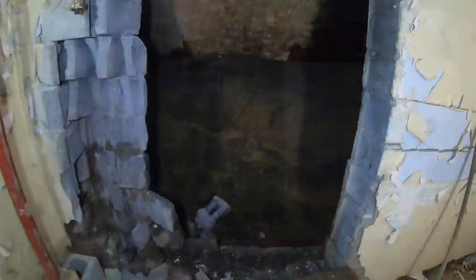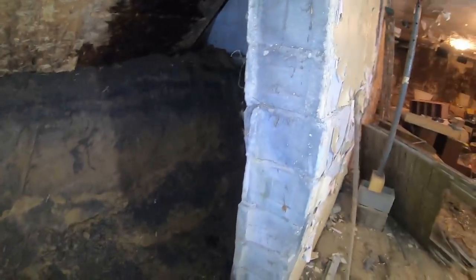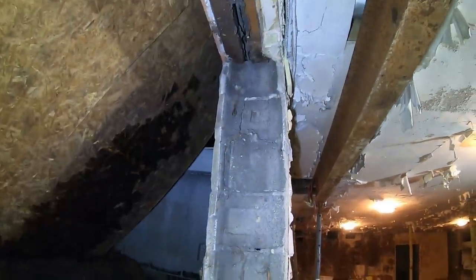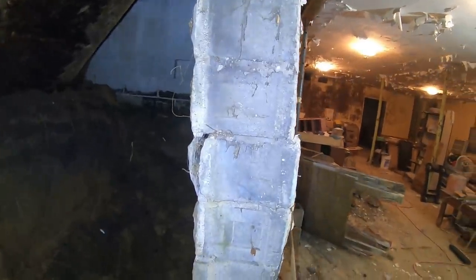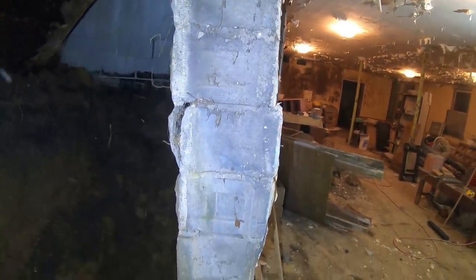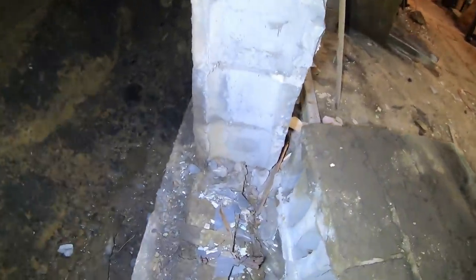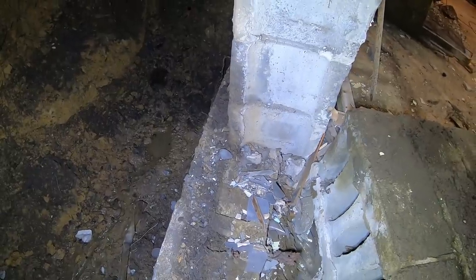This gives you a good cross-section of what the wall looks like so you guys can really see it on camera. It's buckled there and peeling, kicking out. Look how far down at the bottom it slid off the foundation — I'd say that's about three and a half to four inches it slid over.